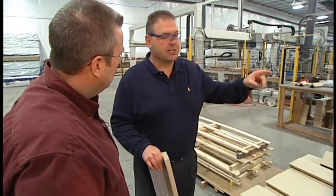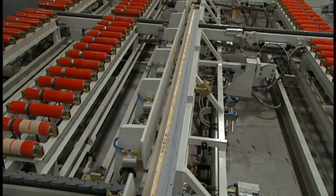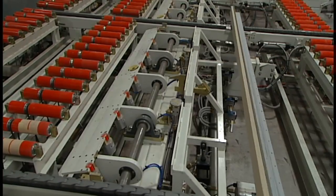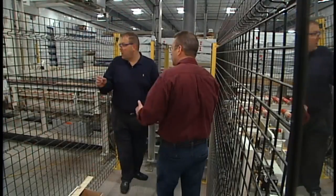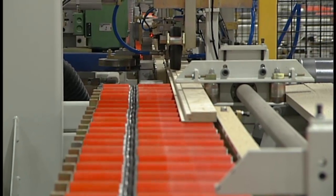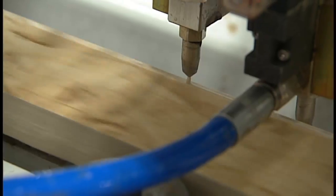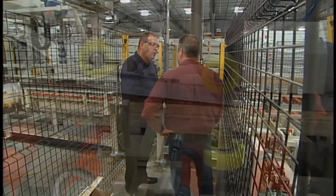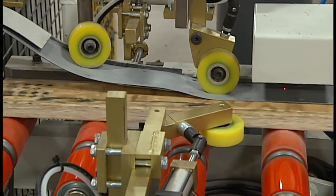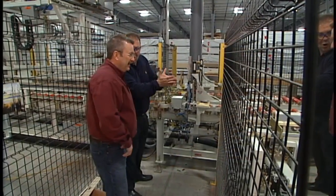Why don't I show you the automation we introduced — let's take a look at the machine and how they're put together. So Stuart, let's talk about where we begin down there at the end. It's run through the glue feeder which will apply a steady bead of glue all the way down the entire seam. From that point, it's brought into this area where we're applying that vinyl nailing fin. The stainless steel staples are applied every five inches, right here in this area. Then it's brought into the clamps and pinched together to make that nice strong joint.